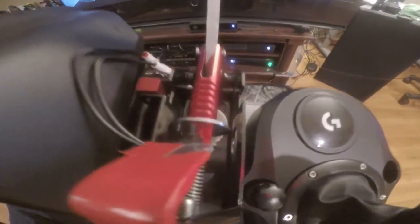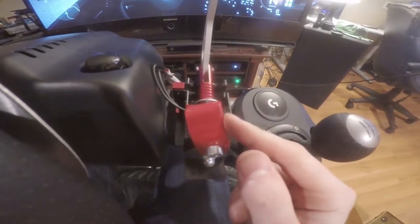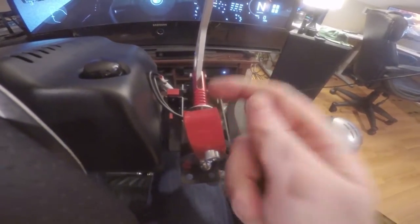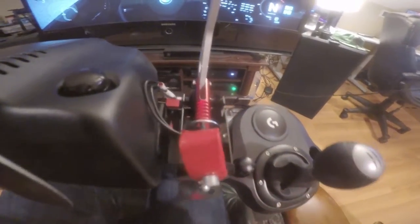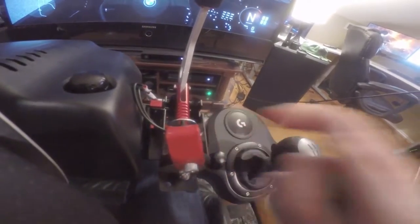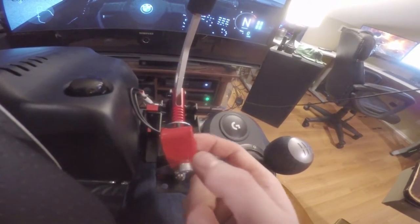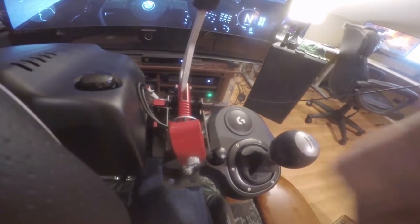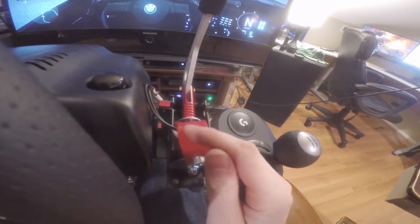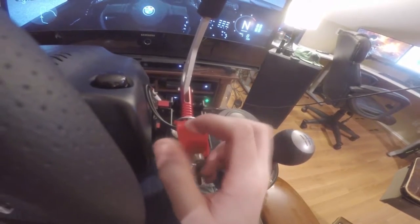So you can see in here I made this little bracket. I put four sheets of really thin aluminum — like venting duct material. I cut those out and made each one a little bit longer so they overlap. The bottom one is a little bit shorter than the top one and it gradually grows, so they all equal just about the same. I layered four up and then put electrical tape over the top to get rid of the sharp edges and kind of match the look.